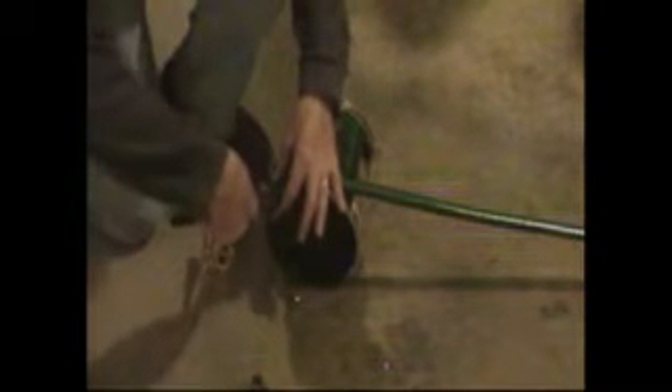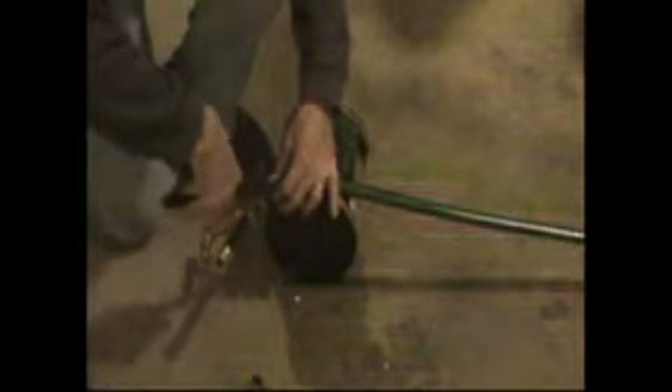Here's where I'm wrapping it around a paint can. I put a piece of wire on the paint can and I'm hooking the hose and the whole assembly onto the paint can so that I can twist it without needing an extra person to hold it. I didn't really worry at all about kinking because the copper tube was very soft and really didn't show any signs whatsoever of kinking, especially around a nice curved form like this paint can.